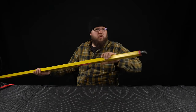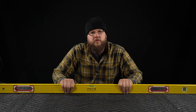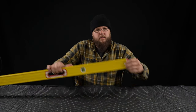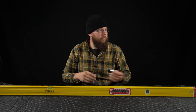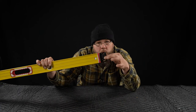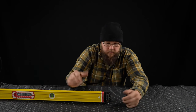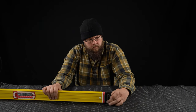Now we're getting into the big dogs. This is a 78-inch — good for doors, good for plumbing doors, amongst many other things, good for cabinets. I've got this little attachment here — it's a Fast Cap. You spin the wheel down and it'll tell you how far out level is, and how far out it is — hence the name. In this case it's reading 9/16ths. If you need to cut a shim or something, you'll know exactly how thick to cut it. Look, my head's level — I'm level-headed.